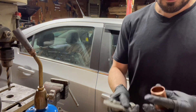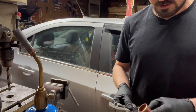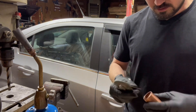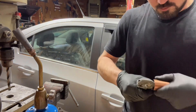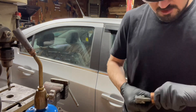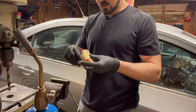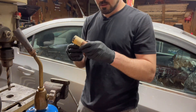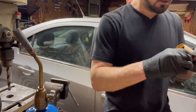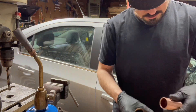These things work really good for smaller parts, like a half inch and three quarter, maybe even an inch. This is an inch and a quarter, so I'm going to be a little more critical with it. It's not quite as clean as I'd like to see it, so I'm just going to give it a little sanding on the outside here. It's soldering — preparation is everything.